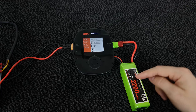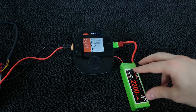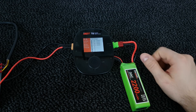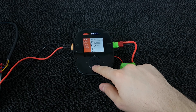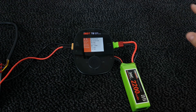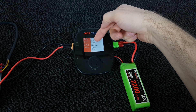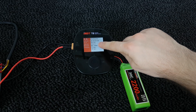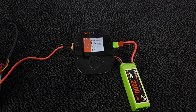We are charging at 2C rate, which is 4.4 amp. We can see this is a LiPo 4S at 15.1 volt main voltage. The display shows milliamp-hours pushed into the battery, the elapsed time, and the cell voltages. Pressing down shows the cell impedance for all 4 cells. Pressing again shows we're pulling 71–73 watt from the power supply, with 67 watt going to the battery. The temperature of the unit is 45 degrees, and we can also see total watt-hours from the power supply since last boot.